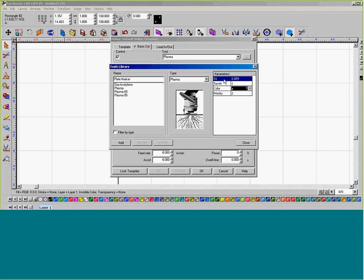This D1 is the diameter of the tool that we are doing it for, for kerf compensation reasons. We can generate as many tools in here as possible and can change the diameter of the tools to allow for proper spacing. Someone who is artsy-fartsy as myself will generate a few of these plate marker tools, each with a different set to allow for different types of spacing. But for this tutorial, we're going to go ahead and change this to 0.05 for our diameter.